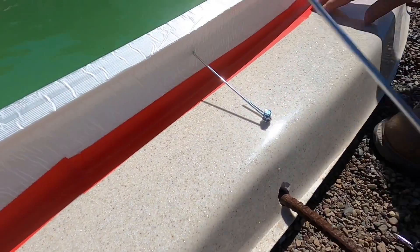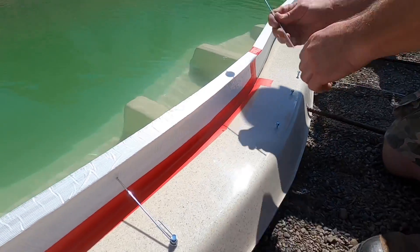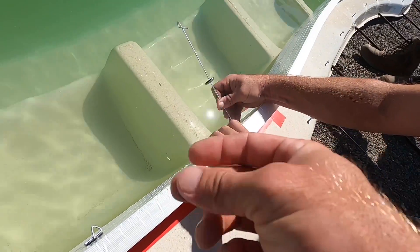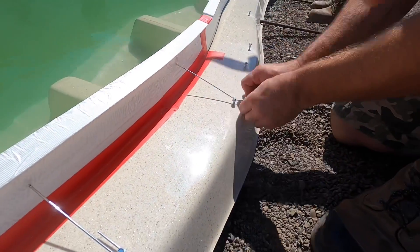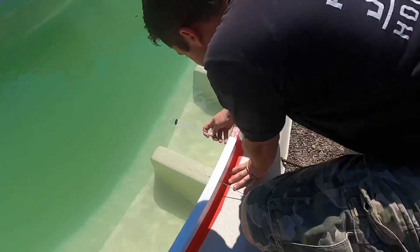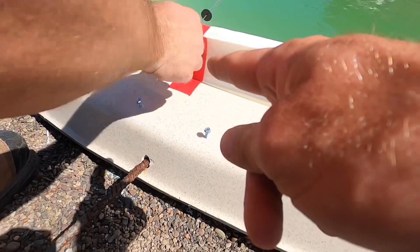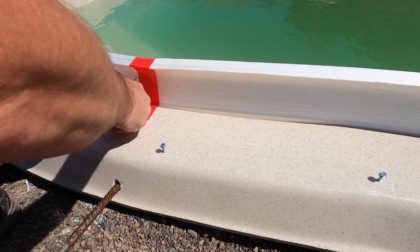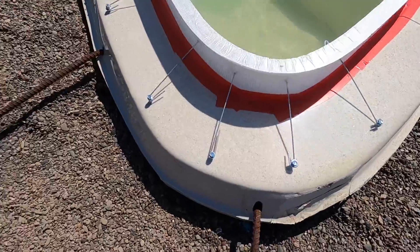You've got your ties for your forms. You twist it through — we're usually about an inch down from the top on this side — twist it through like a drill bit on the other side so you don't mess the tape up, pull it tight, and wrap it around that self-tapper. We have two screws a little close together so on each side of the form we have a tie, making sure the edges don't give out when pouring concrete. For really tight curves, just put a little extra support on those ties.